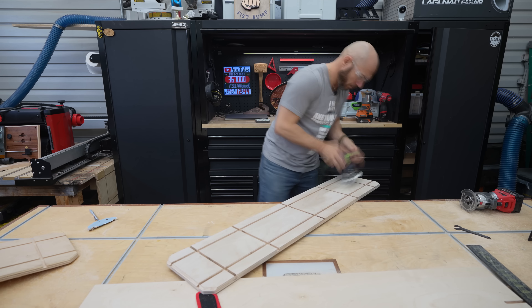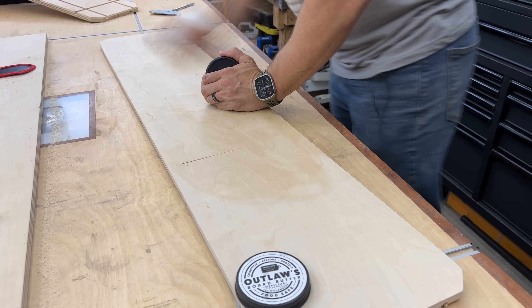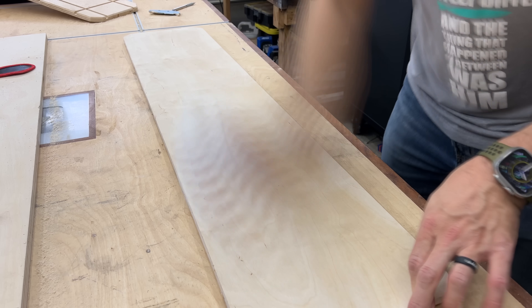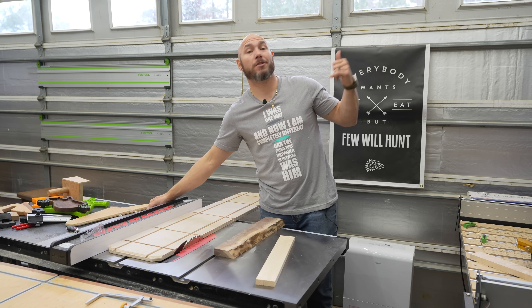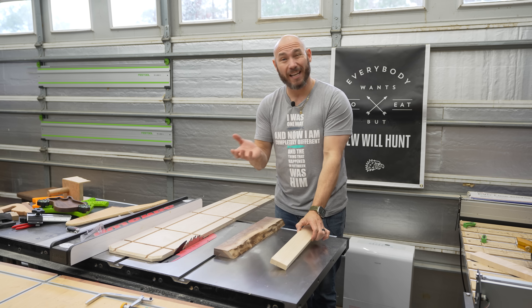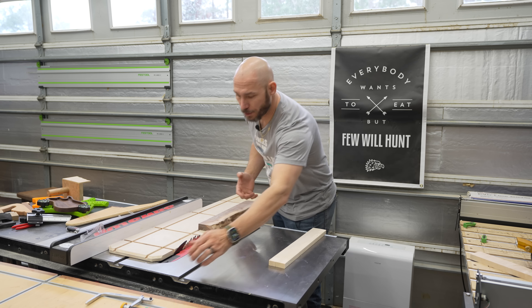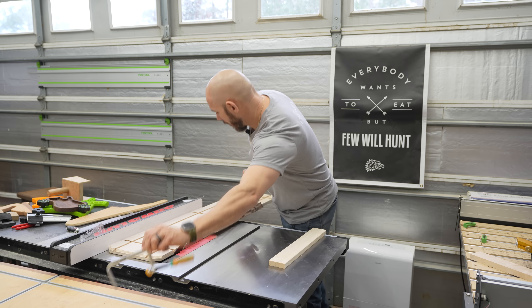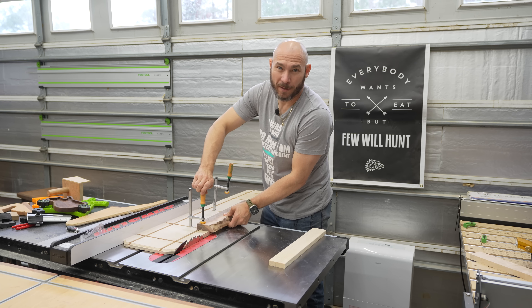This is a framing square fence. You can put it on any framing square and it basically makes it a giant speed square so you can use it as a straight edge or right-angle guide — that's what I'm gonna do. Next, mark one inch from each corner and cut these at a 45-degree angle, basically giving it a little dog ear on each corner just to knock those sharp edges off. You don't have to do this — you can just sand around it or leave it. Just take some sandpaper, 120 grit, and knock off the rough edges and any little splinters.